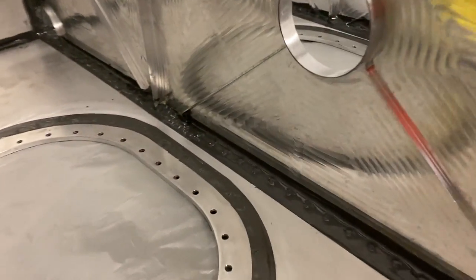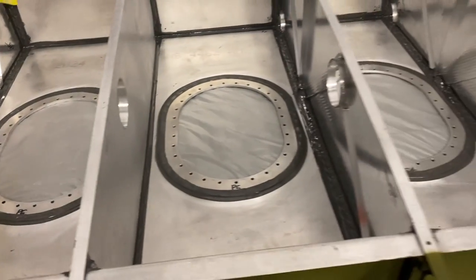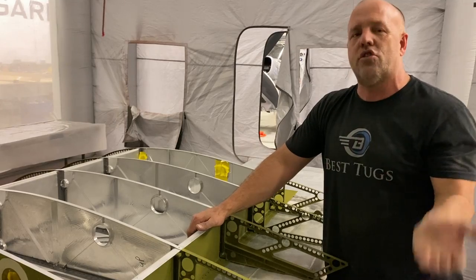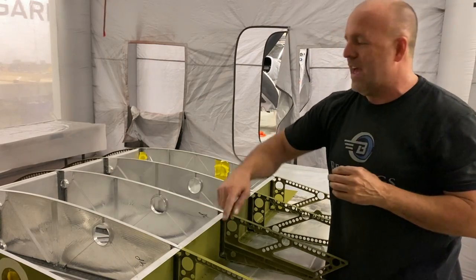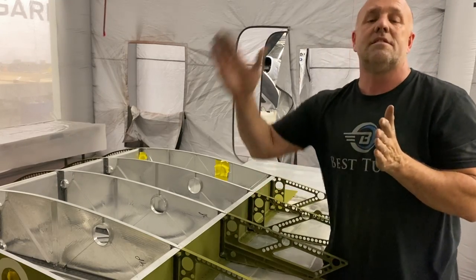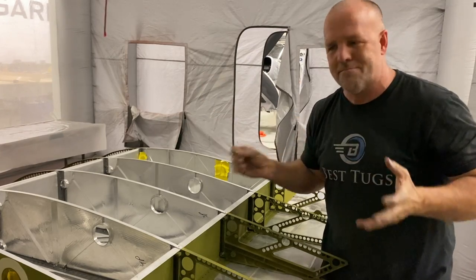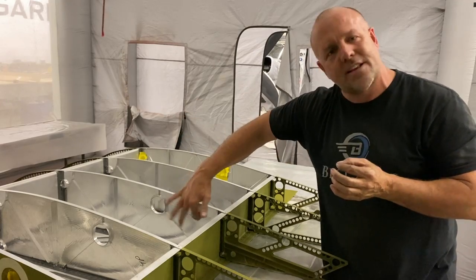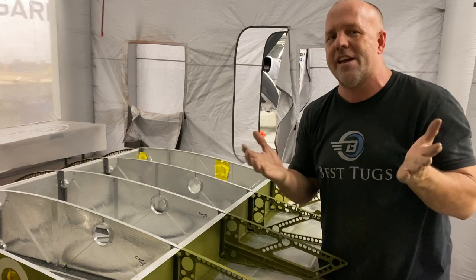But what I'm going to do is go ahead and fill this tank up with the two layers of protection. When I get the lid on it, I'm going to make sure there's no leaks at that point before I do a third layer over top of that, covering everything. That way I know that anything I've done so far doesn't leak, and the third layer is the next layer of protection. I'd be worried if there was some pinhole I missed, and the thin layer that went over everything to protect the aluminum on the sides was the only thing protecting an area I missed.